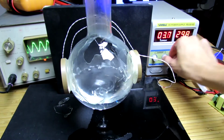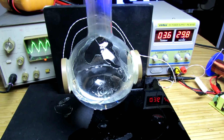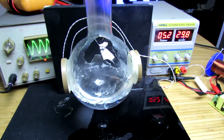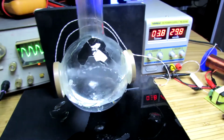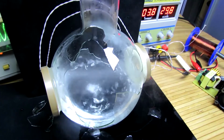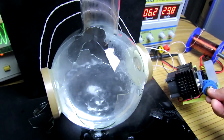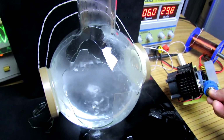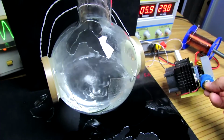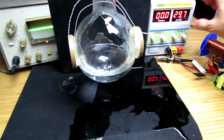We observe the right piezoelectric element on the resonant chamber. At that moment, it cracked and flashes of plasma appeared on it. Judging by the readings of the power supply, the power of the surviving piezoelectric element is approximately 180 watts. At this stage of filming, I was sure that it was impossible to get sonoluminescence at home. And there was nothing more to lose.